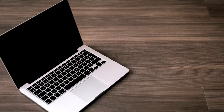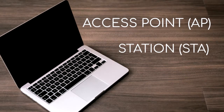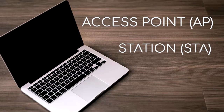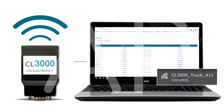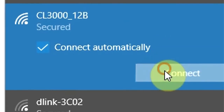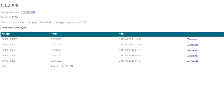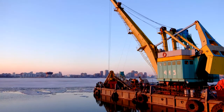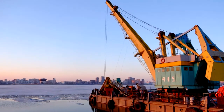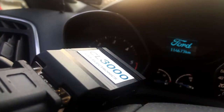To explain how the CANLogger 3000 works, let's start with the two Wi-Fi modes: Access Point (AP) and Station (STA). Number 1 — Access Point Mode. The logger ships in AP mode, meaning it will simply show up as a hotspot on your PC, phone, or tablet. Just log on and access your data by entering a pre-specified link in your browser — for example, 0001/. Example: you're in the field with your iPad and wish to collect data from a hard-to-reach logger. You get in range, log on to your hotspot, and download the log files you need, while the logger continues logging.